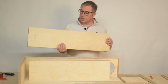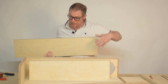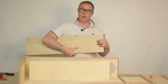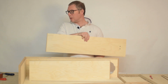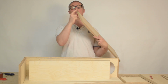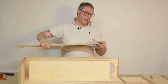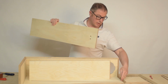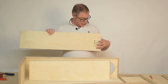The other piece is forming the initial part of the line, the point here, and it's also got the holes in it for our connectors. So this again is just rounded over on the one edge, so we've just got a quadrant that's rounded there. On the top edge here there's a 5-degree angle, which forms part of the angle with the top there.